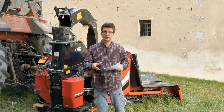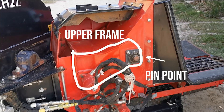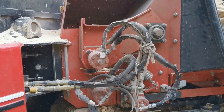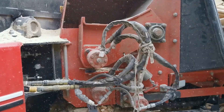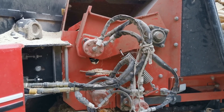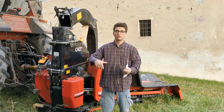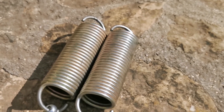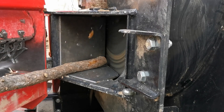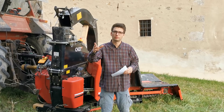Another very interesting aspect about the rollers is the frame on which they are mounted. It is a very big and robust frame, pinned at one point so it is able to move up and down in order to accommodate different wood sizes. To ensure it is always kept down in contact with the wood, there are two big springs keeping it down. Once everything is working, the wood is pushed against the rotor and the wood chip is produced — but that was covered in the previous video.